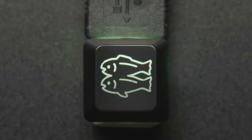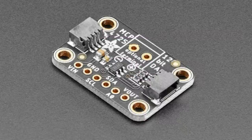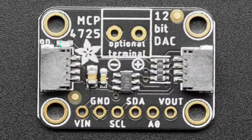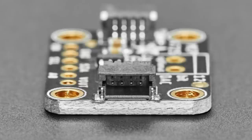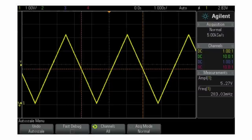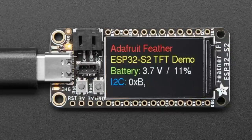Next up, it's a cutefication of the MCP4725. We've had this breakout for a very long time — it's product 935, that's how old it is. We've updated it to be STEMMA QT compatible. The pinout is actually the same, but the physical size has changed, it has mounting holes, and it's got a STEMMA QT connector so you can plug and play. We added a terminal block at the top so you can expose the V-out and ground pins easily. It is an I²C 12-bit DAC, so it's not super fast, but you can drive it at 3.4 MHz in high-speed I²C mode. You can generate sine waves, triangle waves — good for control signal generation. You can have two on one I²C port by soldering the address jumper on the back.